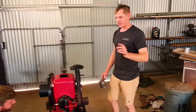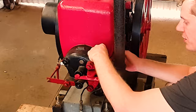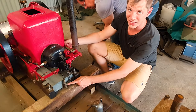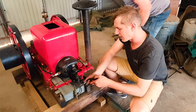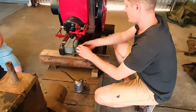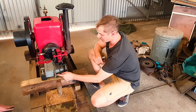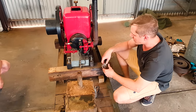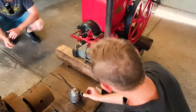Through my very limited operation of this engine, I've just discovered something very interesting. As the exhaust arm is actuating, it's pushing a little sub-lever here, which is also connected down into the fuel tank. So what it's doing is providing pressure into the tank to be able to come up here. I need to tighten the lid a little more so we can actually build up some pressure in the tank, because this line is providing a little bit of air pressure through a basic seal. Every second revolution is creating a little bit of force through here to push the fuel up through the carby. The fact that we don't have that tightened is probably not doing us any favours in getting it running.